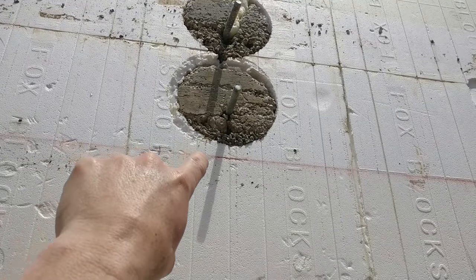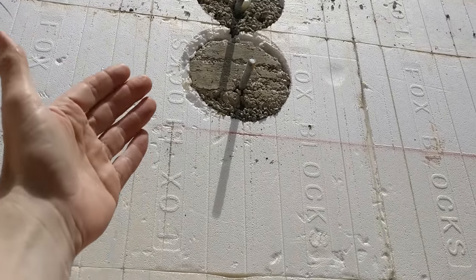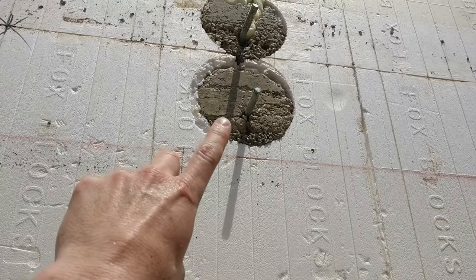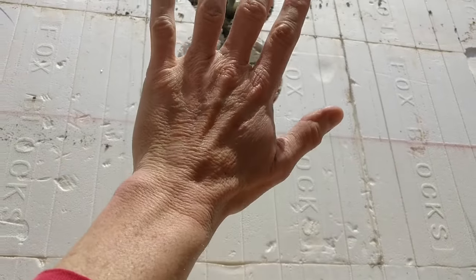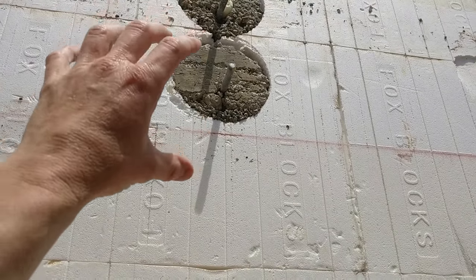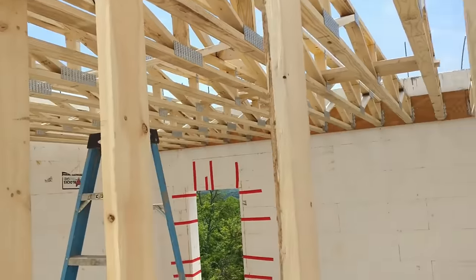So let's look at the anchor bolts and how the anchors were set into the concrete. What happened is they cut out the hole and then that allowed the concrete to slide up there when it was poured. That anchor bolt is — I want to say like eight or ten inches long — so it goes back in there into the center, and it was held on by a piece of OSB with the bolt sticking through it, which held it right in place. When you pour, it stays perfect. Once it dries, you pull the OSB off and voilà — you have an anchor bolt, and it is super, super strong.